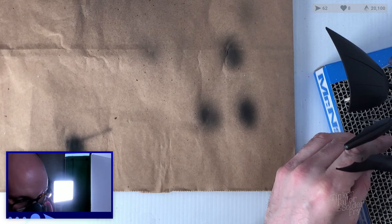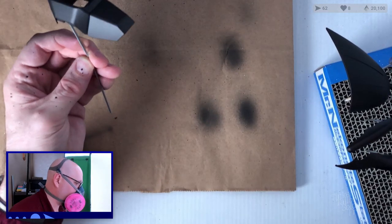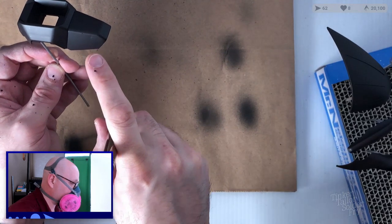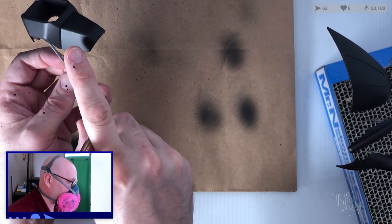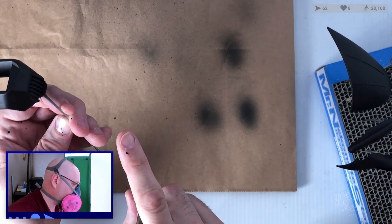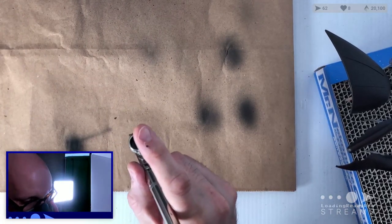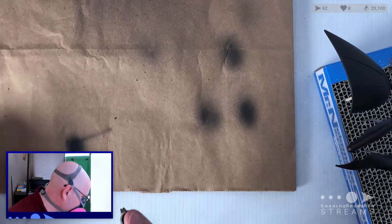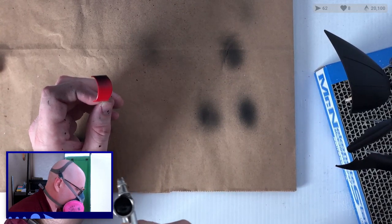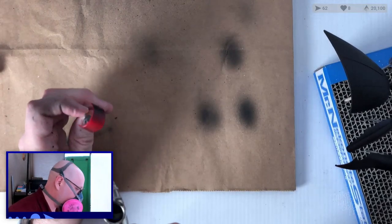These are some very nice pieces. This one, I just want to bring this back. This is the one we were having some spotting on. As you can see, most of the spotting's gone away. Although, it has highlighted this little bit of an indent, maybe of a mold issue. I don't know if I'm going to do anything about that, because I might not care, but that's part of that surfacing effect the primer gives you. The reason I might not do anything about that is because I've learned the difference between inspection at this level versus inspection at the 3-foot level.